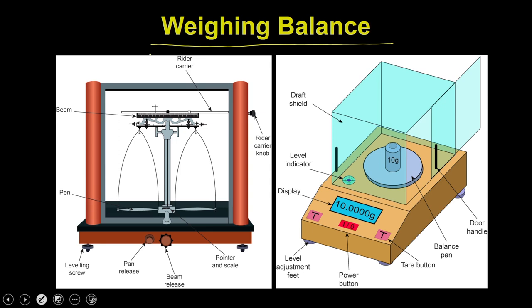If I have to measure 10 milligrams of a compound, I will keep 10 milligrams of weight onto one pan and then start putting the powder into the other pan. When I put the 10 milligrams of weight, it exerts pressure onto the pan and the central rod tilts. You then add powder until the rod is again straight, and by doing so you can weigh the amount of that particular compound.